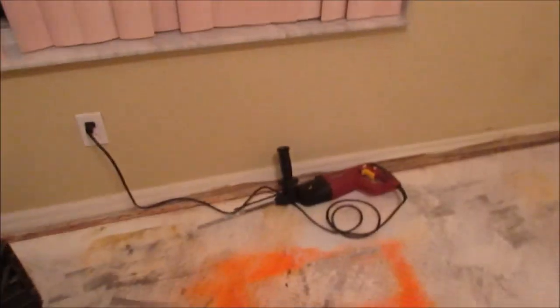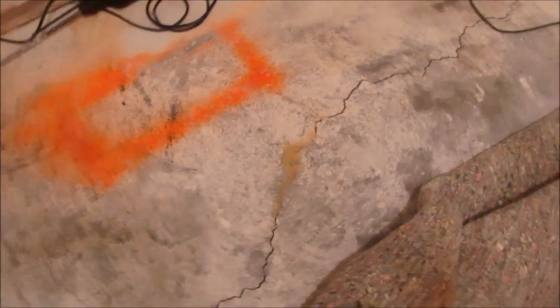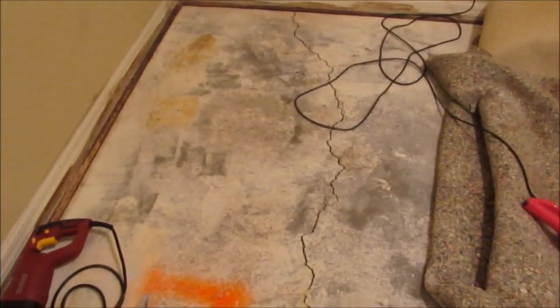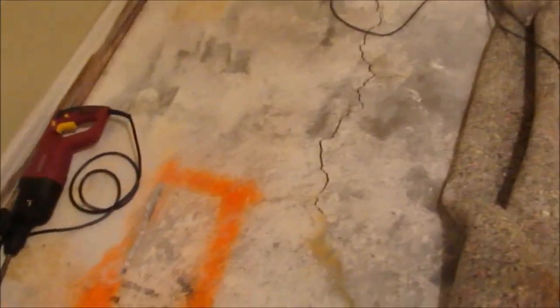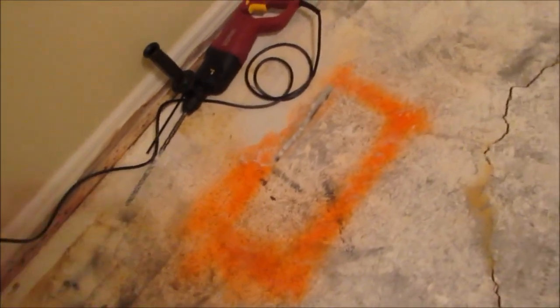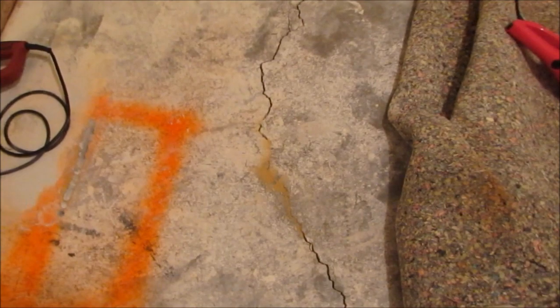The leak is under the slab. Ordinarily if you had a leak under the slab you wouldn't see it percolate up into the room. But there's a crack in the foundation right here where this side of the house settled — you can see the sand right here — and this is where the water came up through the slab from the leak. That's how the water got into the room, and most of it ended up in that corner over there.